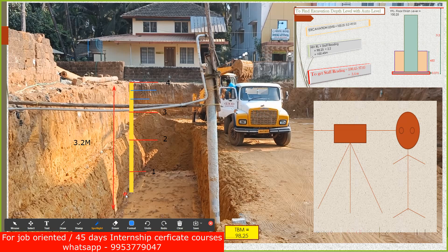That is why whenever you do the excavation, try to do 100 or 200 mm less first so you can verify it, because if you excavate 200 mm more, backfilling becomes a problem. That is why the best idea is: fix a rebar of 3.2 meters as I showed and verify that way. Or you can make use of this auto level to give the level.